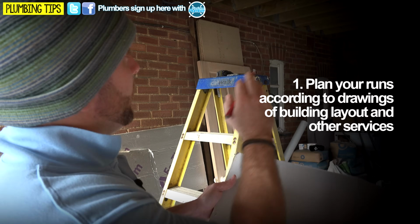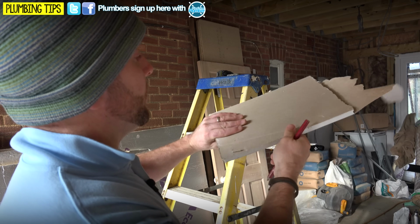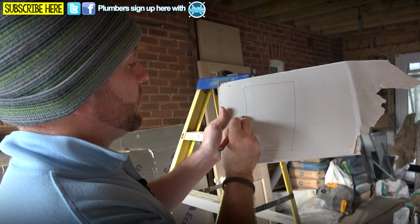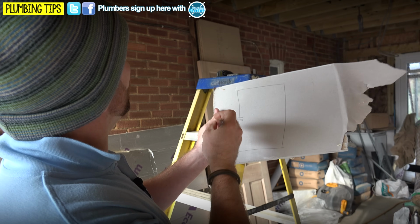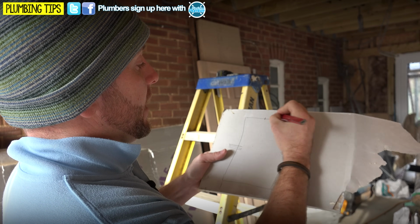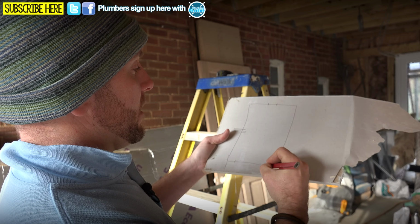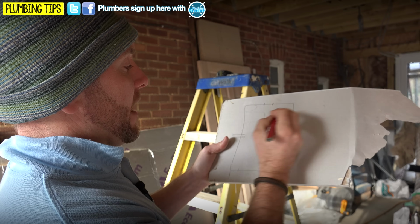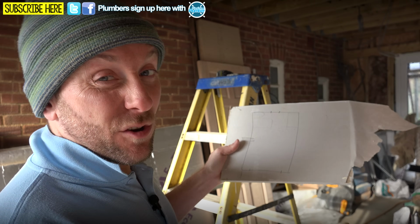So watch me now, I'm going to show you how to measure out the timber, and then basically we're just going to put some holes in, and then in our next video in this series we're going to show you all about first fixing. So let's give you an idea about actually where we're going. We've got our joist going across like that, and this is the general shape of the room at the moment. Now our main services are coming from the house, from the extension through here, which is that joist just up there. Now, above stairs, there's going to be a radiator here, and also a radiator here under the window. This is partitioned off upstairs because we're going to have a loo here, a shower there, and a basin here, which brings us on to the next bit.